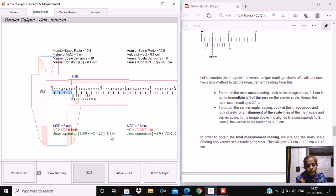Hence the total reading will be: main scale reading plus vernier scale reading multiplied by least count, which comes out to be 8.1 mm, that means 0.81 cm. So if we calculate the length of this rod using a simple scale, it will come out to only 0.8. Here we have accurately determined, using the vernier caliper, that the length comes out to be 0.81 cm. Using the vernier caliper, we can determine the length of any object accurately and precisely up to 2 decimal places.